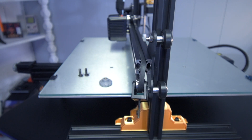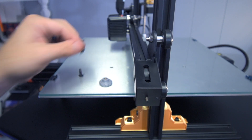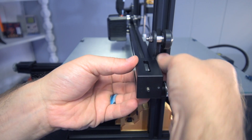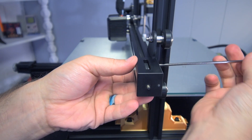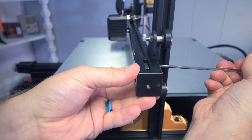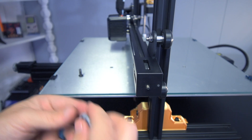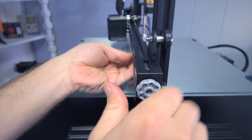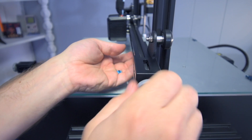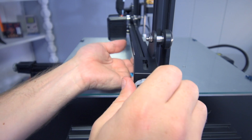So here's what you do — it's actually a simple fix. What you need is a washer. When we go to assemble this back together, take any one of these bolts, put it back on this side, and we're going to make sure that this one is tightened all the way. It doesn't have to be extremely tight, but just past tight is good. Now let's go ahead and get a little bit of tension on here. You can see the belt is real loose, and as we screw this in, it gets tension. You want the belt to be tight — not guitar string tight, but also not loose. You don't want anything skipping.